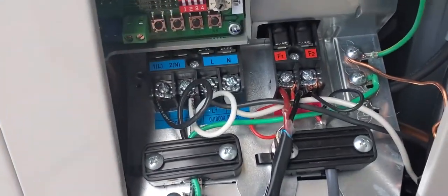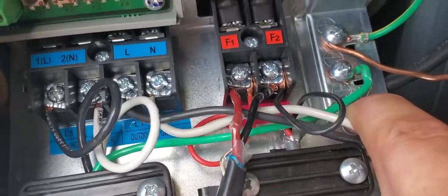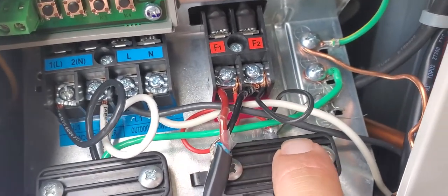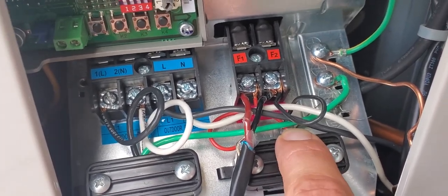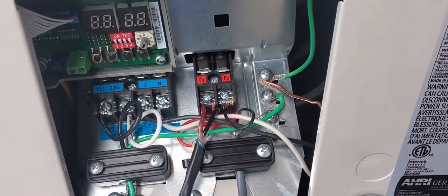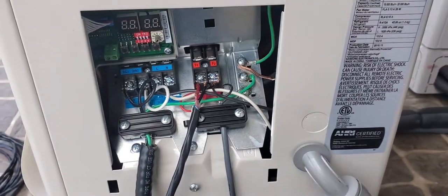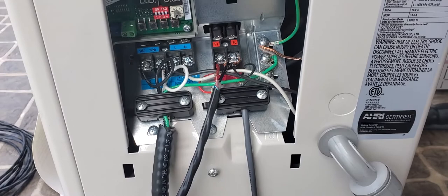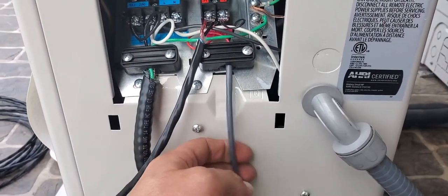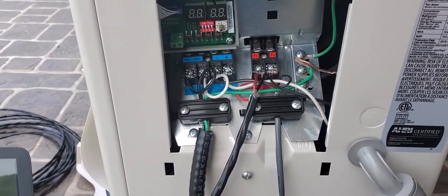F1 and F2 has a ground. The ground — I'll show you — looks like little aluminum. It goes with the shielded cable, I believe it's 16 AWG 16/2. It's grounded at the outdoor unit and not at the indoor unit — remember that. Also, polarity matters: if you choose red for F1 and black for F2, do the same thing inside so you don't have any communication errors. Don't run this wire in the same conduit as a high-voltage wire, and don't splice this wire. If you need to, get a roll of 250 or 500 feet — never splice that communication wire.